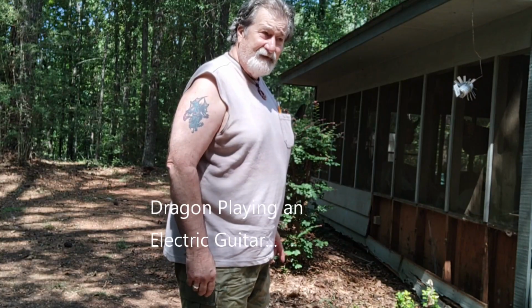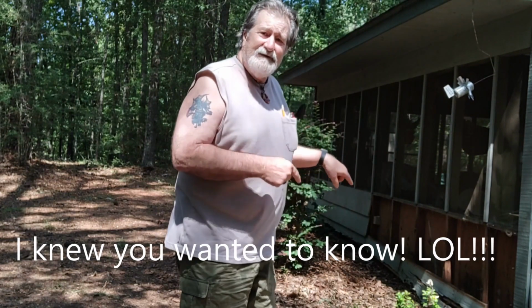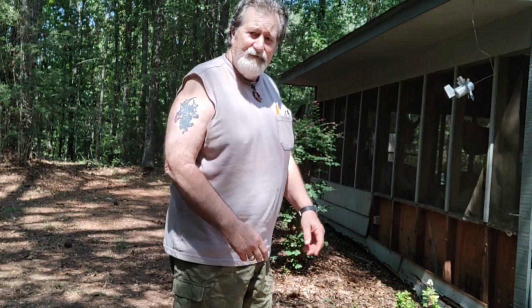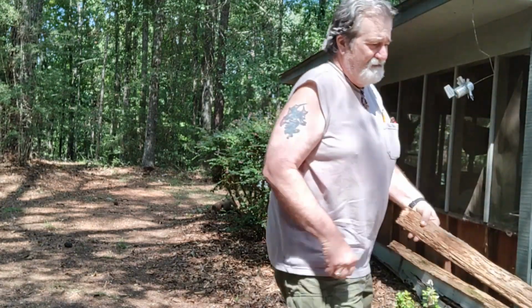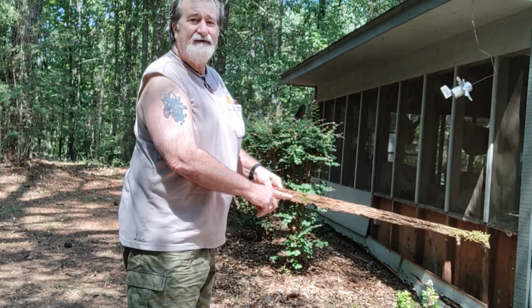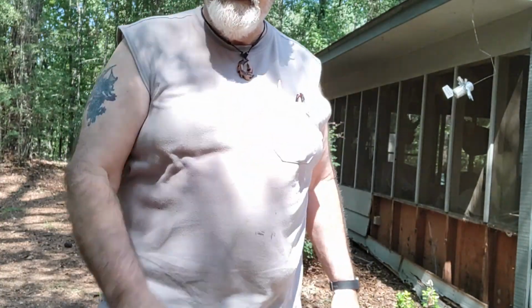Okay, so if all you contractors tune in, find the proper way to actually do this. We help each other, right? Paint both sides of the bottom board so it doesn't rot again. Look at this. You paint this side, but you don't paint that side. So guess what rots first? The unpainted side. It rots all on the inside. So there's my tip. Let's get back to work.